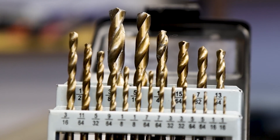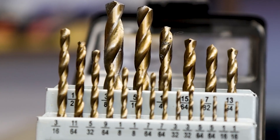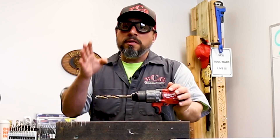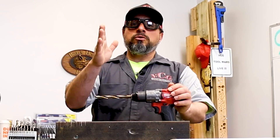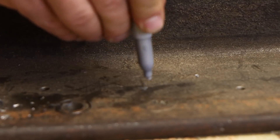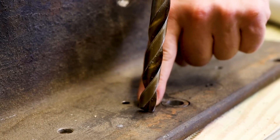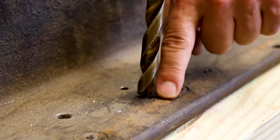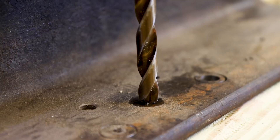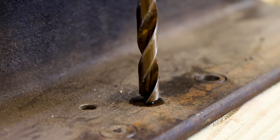Sometimes the simplest or most readily available drill bits are the best for the job. These are so versatile that they should be in everyone's toolbox. We're going to make a little witness mark here on the steel. Walking would be when you place your drill bit onto the material you're looking to drill through, and without that 135-degree split point, the drill bit might move.